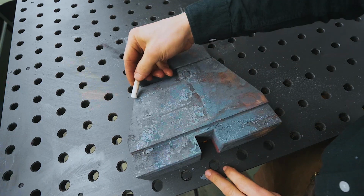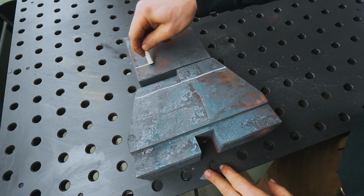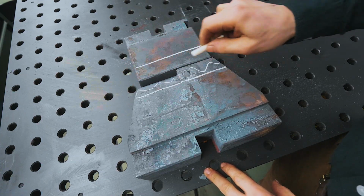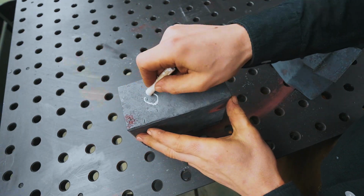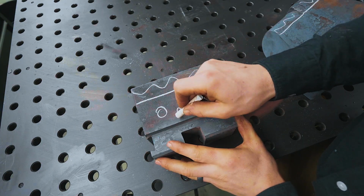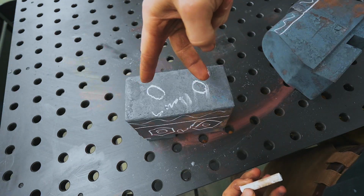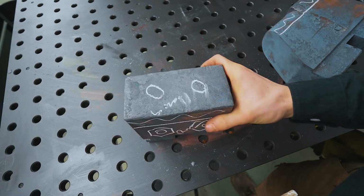So the plan is to turn these dovetail dies into some slightly simpler modular dies where I'm going to easily add inserts by cutting off a bunch of material on the top of each of these. And then once that's been cut off, drilling two 16mm holes. And then on the side of the die, drilling and tapping two 12mm holes so that we'll have a bolt that tightens pegs on the bottom of die inserts that go in these modular thingamawhatsits.